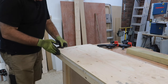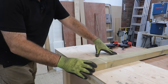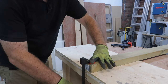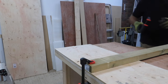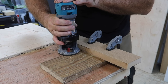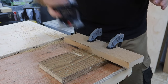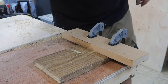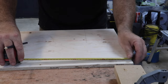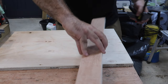With all the cutting done, I lay out both 200mm side pieces next to each other and line them up with the side and end of my workbench, which I know is exactly 90 degrees. I'm going to be routing both together for the shelves to fit in, which ensures the grooves end up at exactly the same height on both. There's an offset between the router frame and the bit, so rather than measuring by hand I route a short groove in an offcut and measure it accurately — for my router that offset is 38mm.